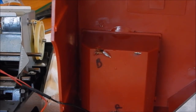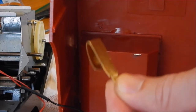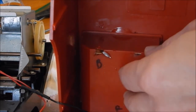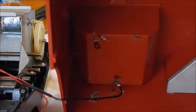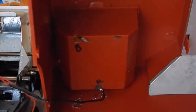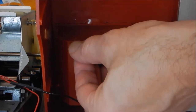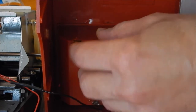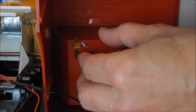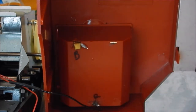Okay, I'm ready to install the new copper terminal. Again, the one I made, and so you're going to bring it in through here. It sticks out just far enough here. My camera can't zoom in too much; it gets blurry. What you have to do is bend it down just a little so it holds it in place, and you can begin to re-solder the wires onto it. There, it doesn't come back out. It's actually pretty sturdy. All right, let's solder the wires on.